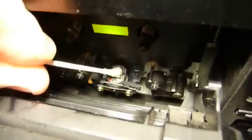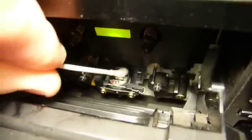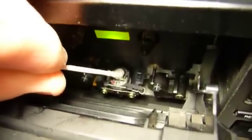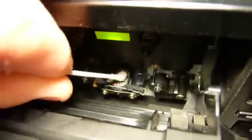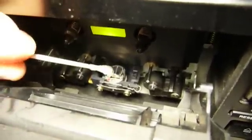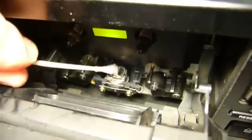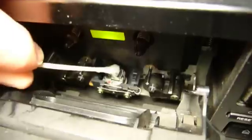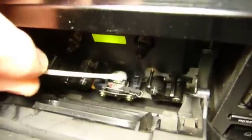The head flips around because only two tracks out of the total four on a compact cassette are played at any time in a normal cassette deck. Some special devices use all four tracks, such as special book-on-tape machines for the blind or certain equipment for musicians. You can see I'm just gently scrubbing the head here and there's a little bit of grime coming off. I'll go in with the other end of this cotton swab and gently scrub the erase head as well. You want to make sure you don't break off, bend, distort, or damage any tape guides mounted to these heads, because then you may really have problems, including a deck that eats tapes.